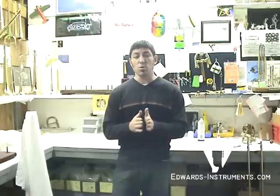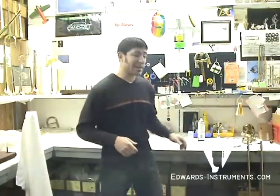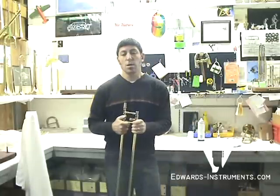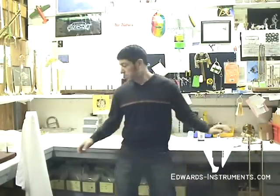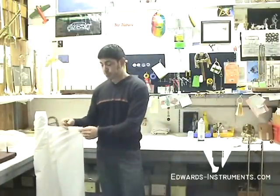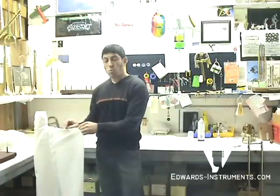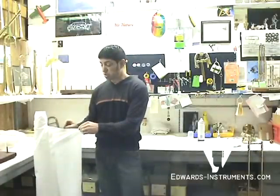If properly maintained on a weekly basis, your slide should never degrade and should maintain its character as it was new. So what we'd like to go over is just proper slide cleaning. In order to do your slide cleaning, you'll obviously need your slide, a clean environment, and some muslin or cheesecloth you can get at your local cloth store. What we do is we go at approximately 6 to 10 inches wide on the cheesecloth.